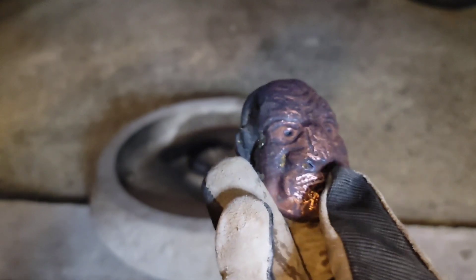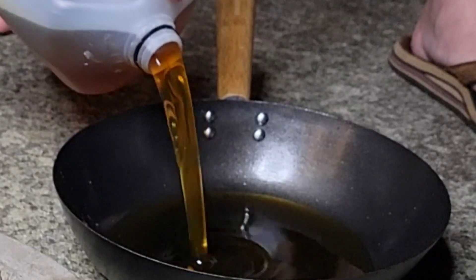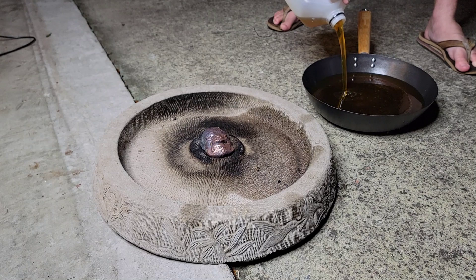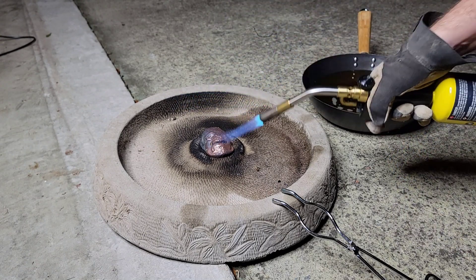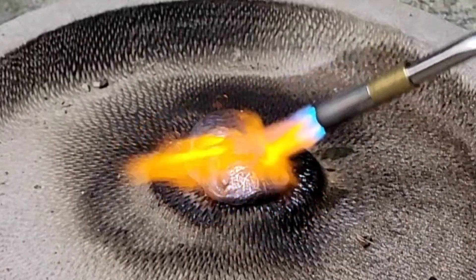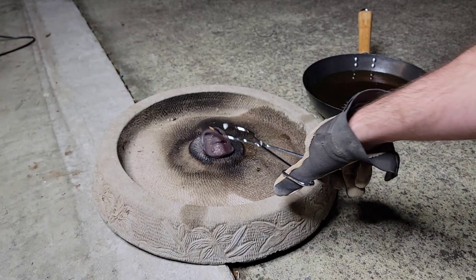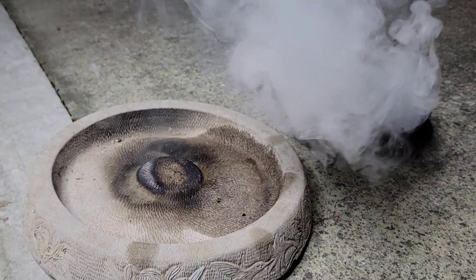It's looking pretty good, but I think we could do better with a bit of a peanut oil patina. This part requires some extra precautions because you certainly wouldn't want to do this in a closed space or next to anything flammable. The basic idea is that we heat this mask up to near red hot temperatures and take it to quench in the peanut oil, as seen.